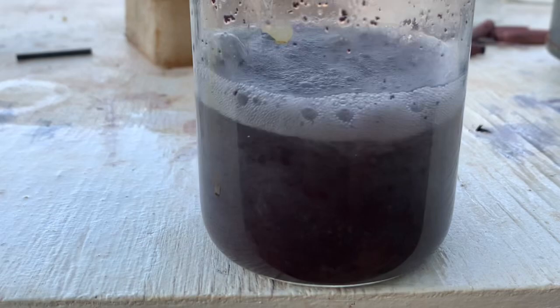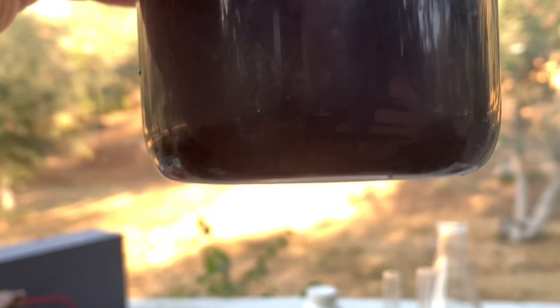Okay, you see copper color. Clean copper, and in solution we still have this zinc. If there is no more copper, then zinc starts coming out because we're putting in aluminum. But because aluminum and zinc are very close to each other, zinc comes out very slowly. If I had magnesium, I'd put in magnesium and right away all the zinc would come out. I wish you guys understand what I want to explain. And now it looks like the solution is getting dark again, you see? That means we're already getting zinc out.